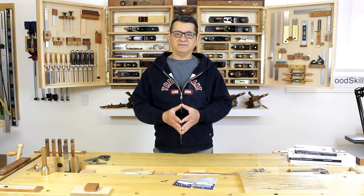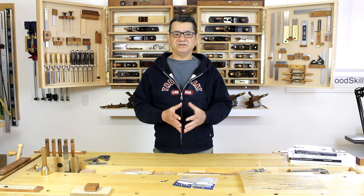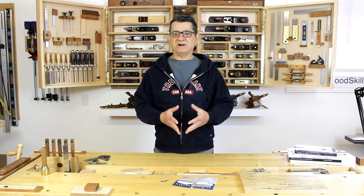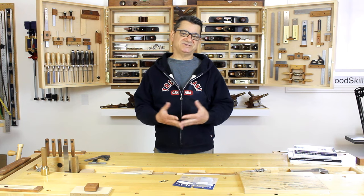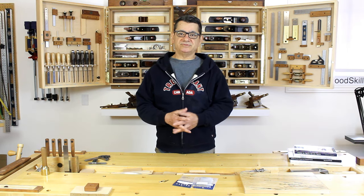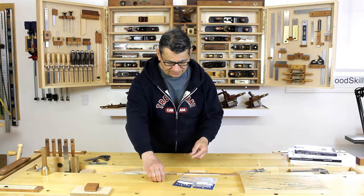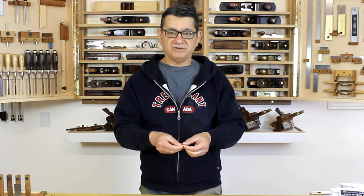The only visible part once the door is installed — for example on a straight knife hinge — is a protruding pin. The hinges themselves are very nice to look at. For the most part they're machined brass — the higher quality ones — they're not stamped metal. Although stamped metal ones are available, I tend to use machined brass ones. This is an example of a straight knife hinge that I use, and I've almost standardized this size to my work.